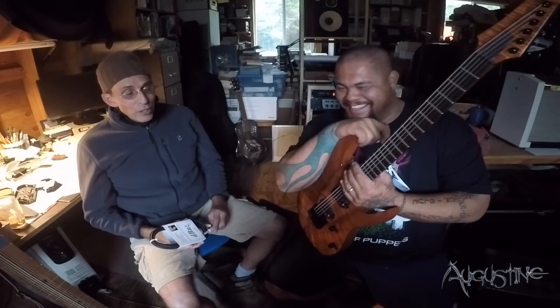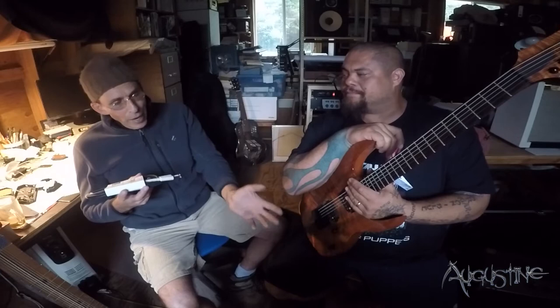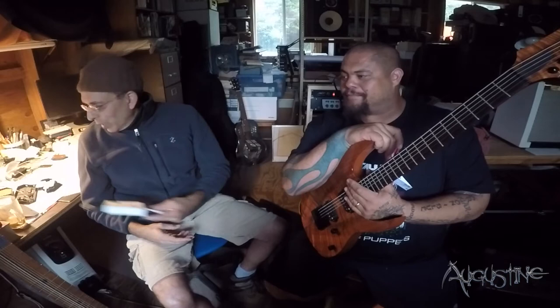It was actually Jeremiah that inspired me to create the D-Buzz, because he had a really noisy guitar. This thing existed in my shop as another device that was more complicated — had to be installed in guitars. One day I was saying, boy, if it was just in a cable — and there we are. His Ibanez had graphite paint inside, and the graphite paint was acting like an antenna, picking up all the noise in the room. It's only because the Aero pickups are hot enough to amplify that noise — the pickups he had before were so dead the noise barely came through. He plugs in the D-Buzz and the noise goes away. Life is good.